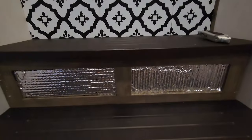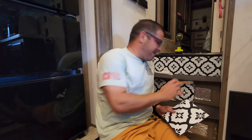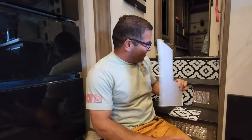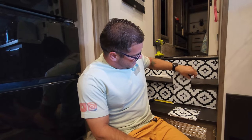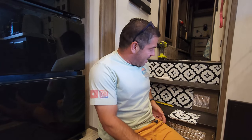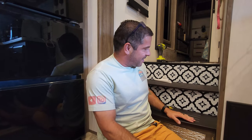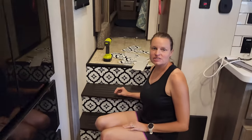Something I'm learning very quick — I've already made a wrong cut because I measured backwards. If you've ever put up crown molding in a house, you know it's a pain. This isn't quite as bad, but since you're going the opposite way I already made a wrong cut. Just go slow, and as the old saying goes, measure three times, cut once. It's kind of funny now that we're on our last cut. Oh thank god that fit — so this one actually fits and we're good.